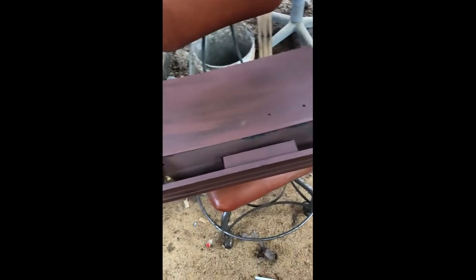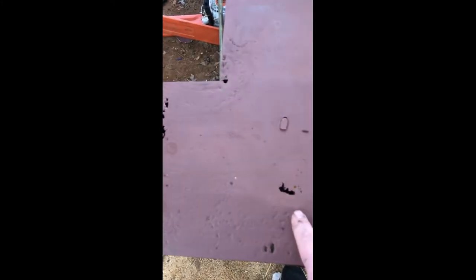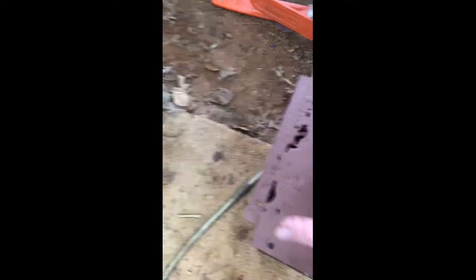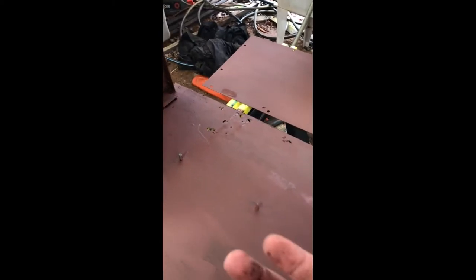Here are some of the parts to my bus heater. We've taken them completely apart, and I've sanded everything or wire brushed it. You can see we've got some pitting of the metal, but it's still solid. I am going to patch this because air does flow through this thing. Here is the fresh air vent of the unit, and then it comes through that coil, and it has blowers. I'll show you what the blowers look like.